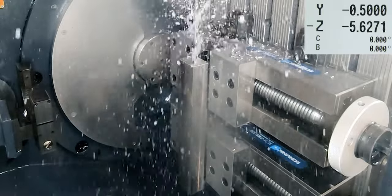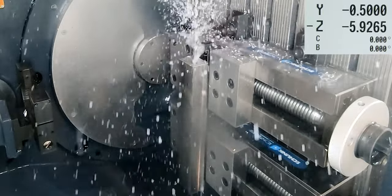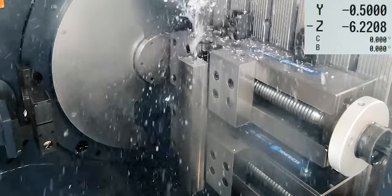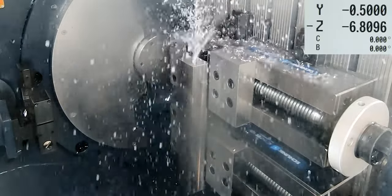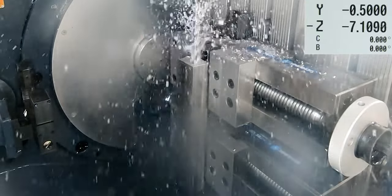So when Kennametal actually chose these drills as a pilot and a deep hole, they looked at the tolerance. And the pilot has a greater tolerance on the high end, meaning the diameter is bigger, and the deep hole drill actually has a tolerance that's on the lower end, which makes it slightly smaller, right? We're just dealing with a few tenths, because once that deep hole drill starts and it's traveling through the hole created by the pilot drill, you do not want it cutting material. You just want the pre-diameter hugging the deep hole drill just to position it perfectly. So as it drills the material and it goes deep, it's perfectly straight.